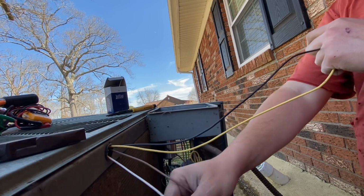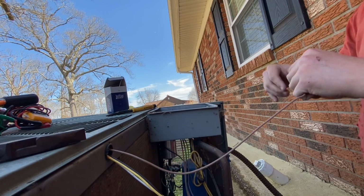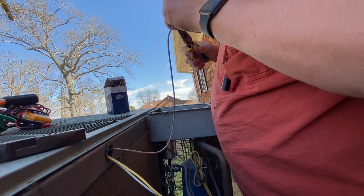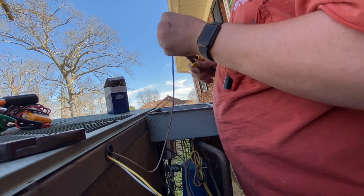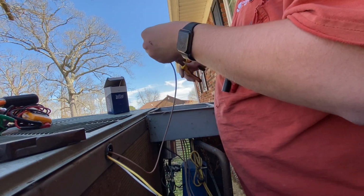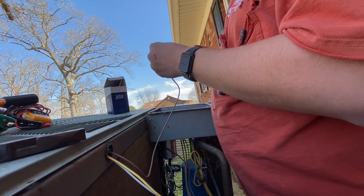It's also why you'll see me do it every time, is yank the ground wire off a motor. I've heard people say, well, they put that wire there for a reason, well, it could short out. Well, guess what? That compressor don't have a ground wire on it, and the original fan motor didn't have a ground wire on it. Why are you gonna put one on the universal? It's tied to this frame, cabinet or the frame, whatever you want to call it.